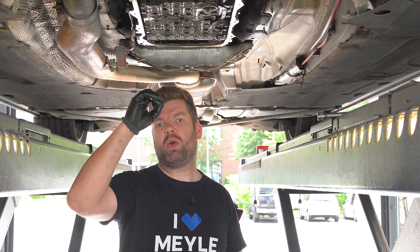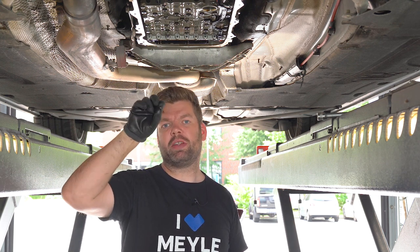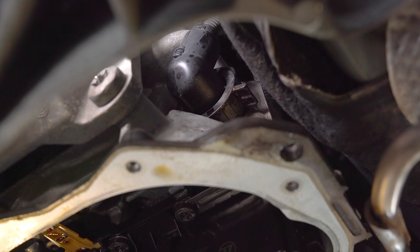While I do the oil changes on the gearboxes, I always check the electrical connection at the gearbox — the sleeve where the wiring harness goes into the gearbox. Here in this particular situation the oil is leaking out, so we will replace the sleeve.